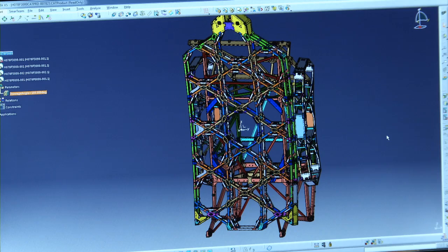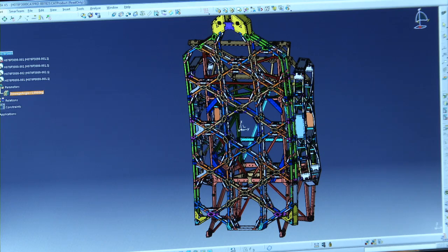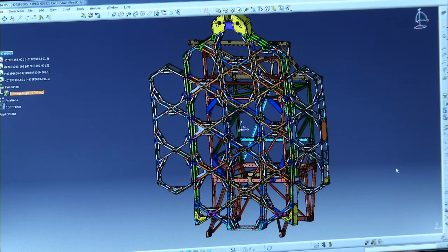This design shows the wings in a deployed condition. When it's on top of the spacecraft prior to launch, they're folded back. There are four launch locks on the outboard corners of the wings. A launch lock is what is used to hold the wing in its tight-packed position, so it keeps it in place during launch. Then once it's through the launch environment, the launch locks are released and the wings can be deployed into their final position.